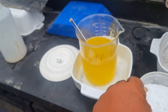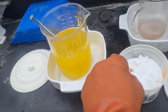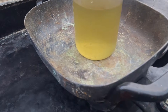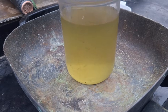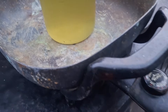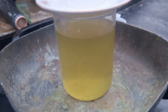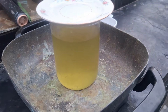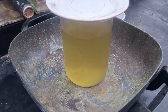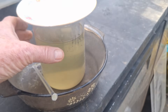Added some urea to knock out any residual active nitric acid and stirred it up. Added a little sodium sulfite. There's almost no gold — just an incredibly small indication, maybe a tiny bit floating on top. I'll stick it on a burner for a few minutes to warm it up and see if we can get that to drop out. Just like three tiny tiny little specks, but we want to make sure we get everything out of that ore and give Jason at Mount Baker Mining a fair shot.